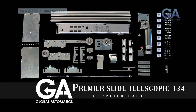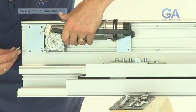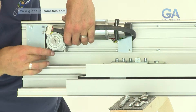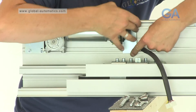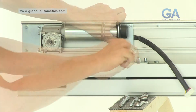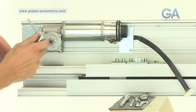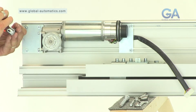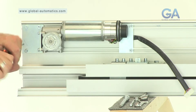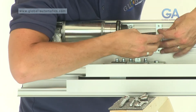Stage nine, fitting the motor gearbox. Select the motor gearbox, one cable strap and eight Allen bolts. One, insert six Allen bolts by hand as shown. Two, tighten as appropriate. Three, fit the cable strap with two Allen bolts, ensuring the cable is not trapped and is positioned centrally behind the cable strap.